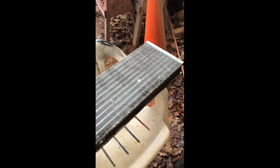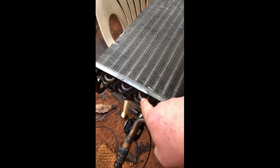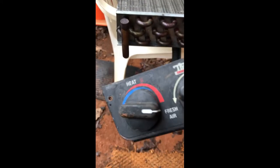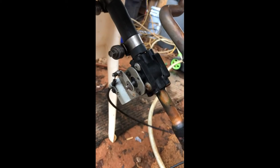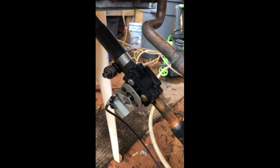This is the heater core out of our front bus heater, and it's basically a heat exchanger — meaning the antifreeze runs from the engine into the heat exchanger, runs back and forth across these coils, and then we force air through here which is heated up and we become heated. These mostly have a little connection with a knob you can turn. As I turn this knob, you can see it effectively just turns that switch — it's just an on and off switch. By turning it to different degrees, you're letting in a whole bunch of water, which is very hot, or a little bit, which is not going to be so hot.